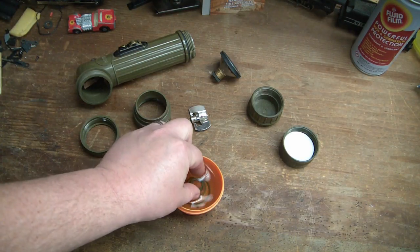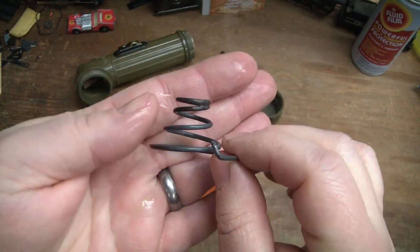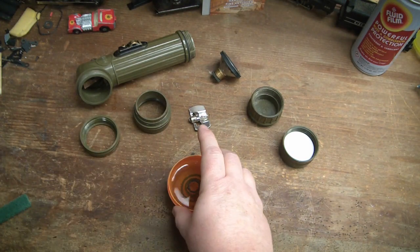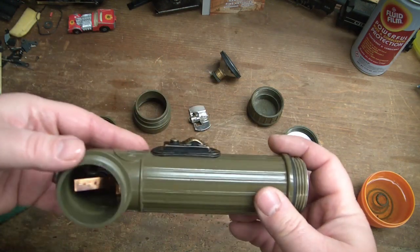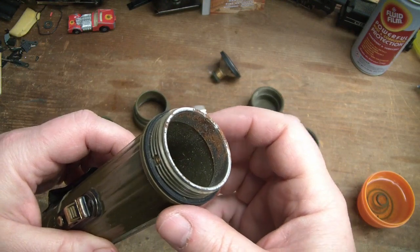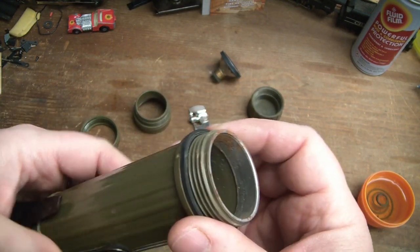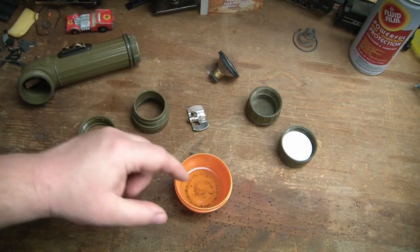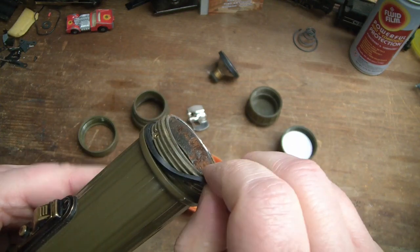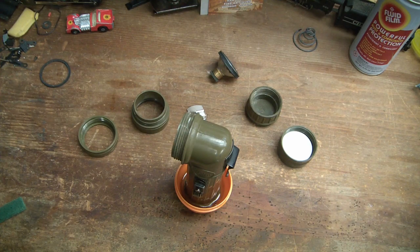The battery spring has been soaking for a few days, and I did brush it part way through. It looks pretty good — I think the Evaporust did a great job cleaning that up. Most of the stuff inside is copper, except this ring here which is rusty. I'm going to dip this end into the Evaporust and let it take care of that rust too. I poured some of the Evaporust out of the cup so it's not quite so deep to get at this rust, then took off the seal. I'll let that soak for a little while.